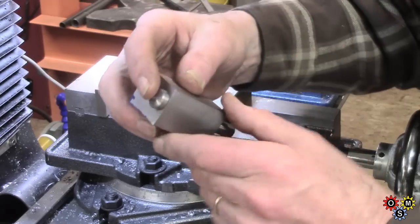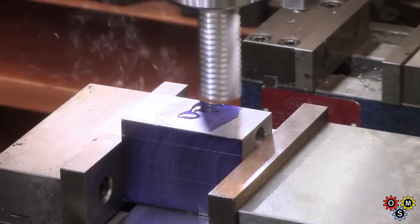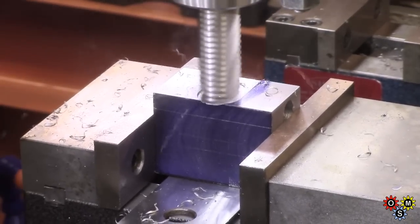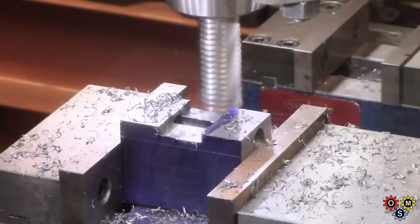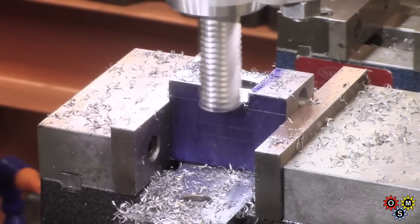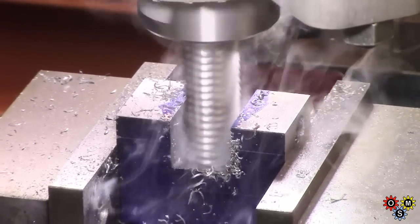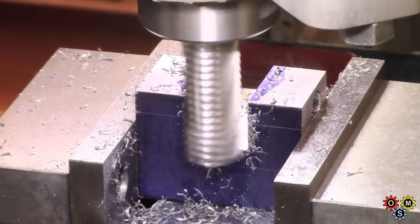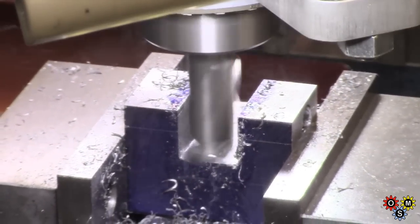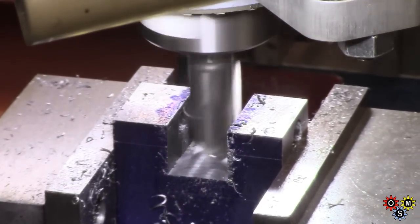The end there we've made so that it sits pretty much flush against the end of the block. Now we've got the 7/16ths through-hole, we want to mill out a slot to receive a knurled vernier scale, which will be threaded 7/16ths to 20, just using a roughing end mill to get down to the depth that we need. We're getting close to the end depth, and then we'll swap to a finishing cutter. Just taking 5 thou off the bottom to clean that up, and then we'll clean up one side — basically probably only about a thou — clean up pass.